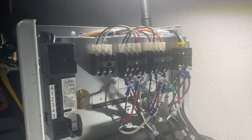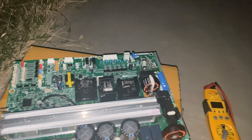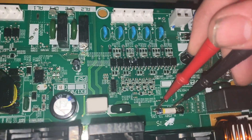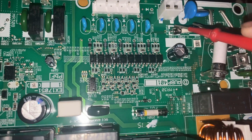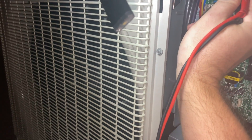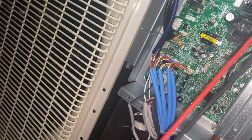Now I've got to wait another week for another board. We'll be back once we get this thing up and running. I've been testing and found we have two direct high voltage shorts. I also noticed there are fuses on the board — checking continuity, that one's good, this one's good, but this one is dead. And the same fuse on the new board is also dead.